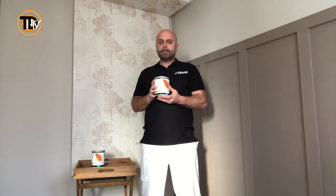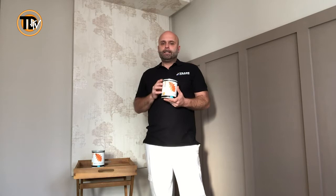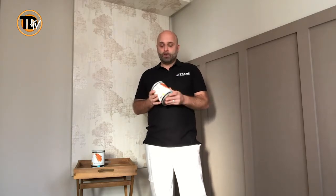A few facts: it's an exterior wood varnish for hardwood and softwood and comes in a satin and a dead flat finish. Polyvine are the only manufacturer to make a dead flat matte finish in exterior varnish, so bear that in mind when giving your customers options for finishes on external timbers. It's an acrylic clear acrylic hybrid, especially formulated to protect against ultraviolet light and rain damage, and it's also microporous, which is good.